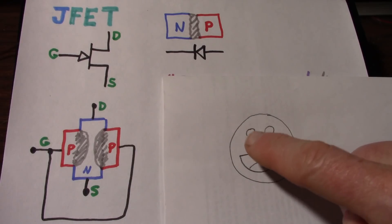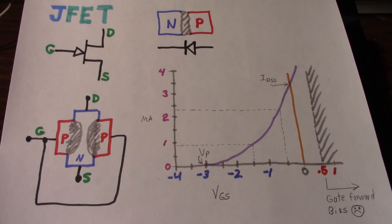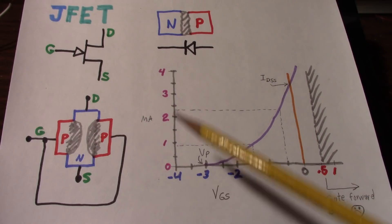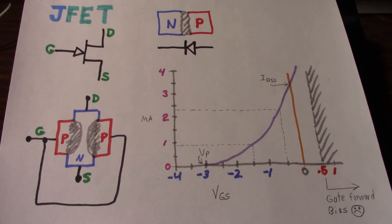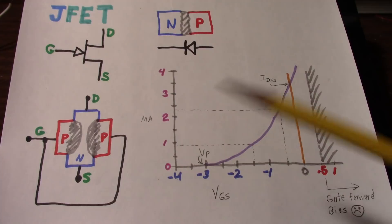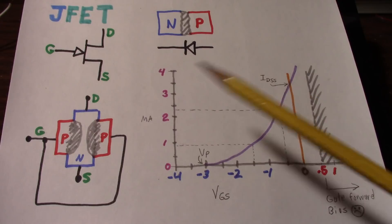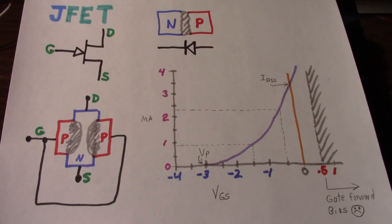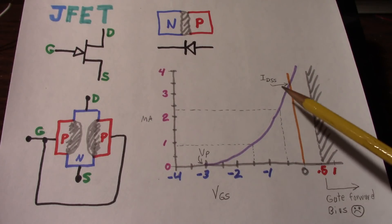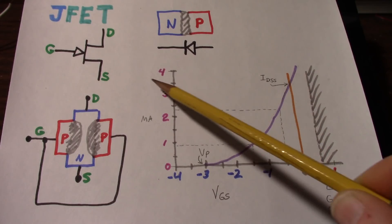So I have a little smiley guy here, which really gives the camera something to focus on. What we have is a transfer function graph of the JFET — an N-channel JFET. The X-axis is the gate-to-source voltage, and the Y-axis is the drain current, or drain-to-source current flowing through the device in milliamps. This is a hypothetical device — I just made a graph up for explanation. If the gate-to-source voltage is zero and you go up where the line crosses, you'll see a certain amount of current in milliamps.